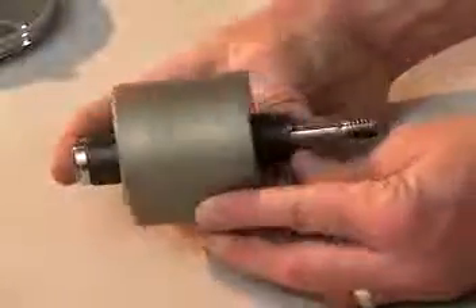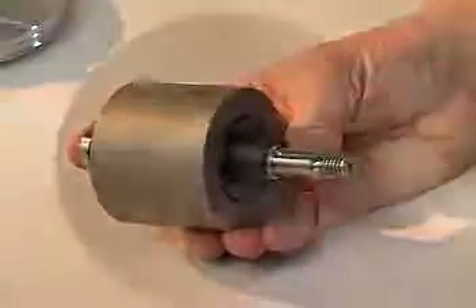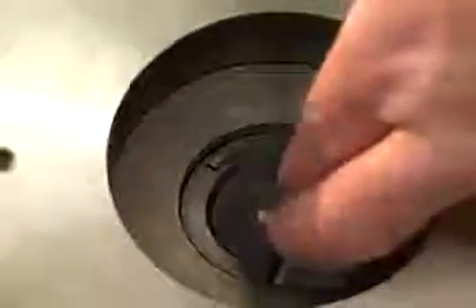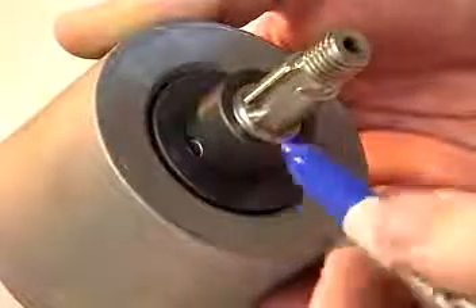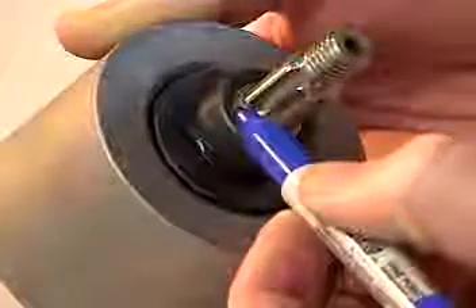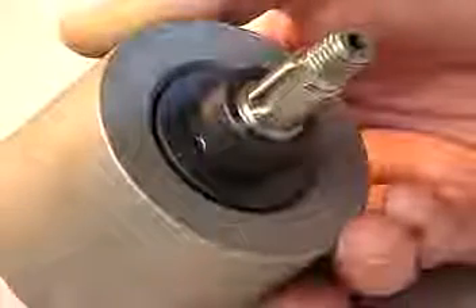Make sure that all contact surfaces of the components along the shaft lay flush with one another. Make sure that the bushing pin is in position in the small hole at the bottom of the rear casing. Place a bushing in the bottom of the rear casing with the indentation facing and fitting over the bushing pin so that the bushing is fully seated. In order to assure proper alignment, use a pencil or pen to place a mark on the sleeve on the opposite side of the notch but in line with it — we will use this mark later.